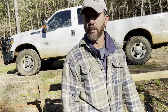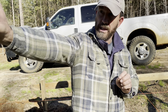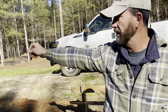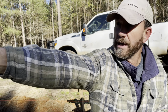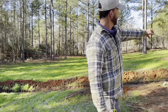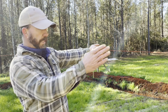What I did is I measured off of this mark over to the string that's running parallel with it — I think it was like 54 feet. It doesn't have to be any certain measurement. All you want is to get a mark down there right as close to the batter board as you can get it. Then from that corner I measured 54 feet and made a mark on this side. Then you take your 100-foot tape and measure from that 54-foot mark to that 54-foot mark, and get the center of this line over here. You made your 54-foot mark here off of that corner and your 54-foot mark here to that corner, and you've got the center between those two marks.